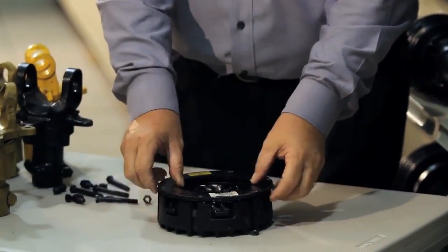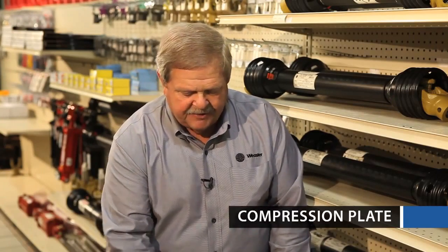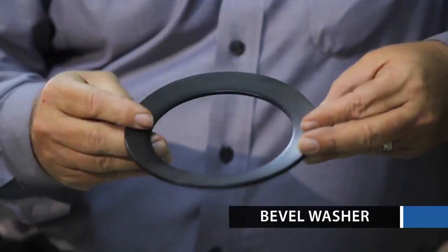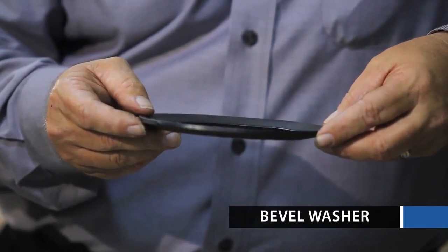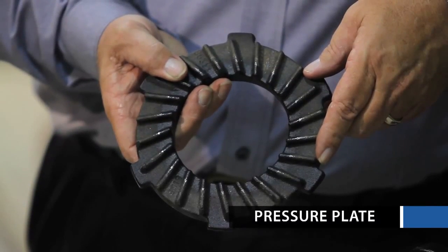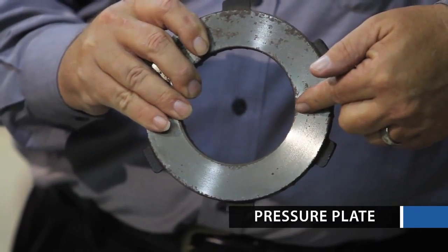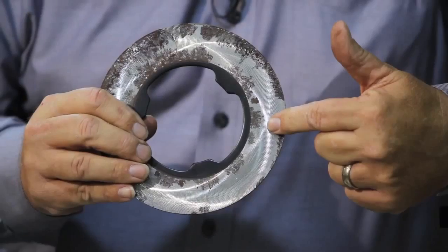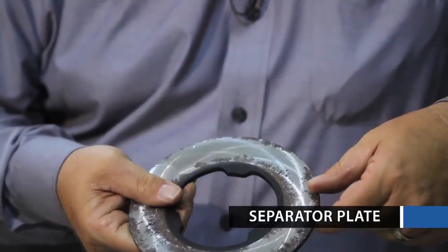I've got it apart. The back is just a plate — a centering plate that holds it together. Then you have the cupped washer, or Belleville washer, that fits inside, and this gives you your inch-pounds or your torque setting. Next, you have a gray iron plate that goes down and has a surface that actually goes against the friction disc. The friction disc goes onto a centering plate here, and the center plate is actually knurled. The knurling lets it only slip on the bottom side, so the heat is dissipated by the fins.